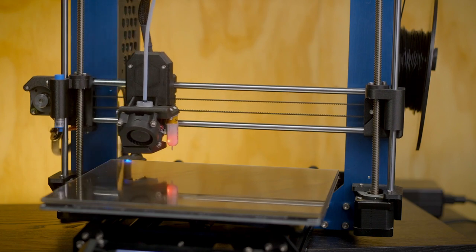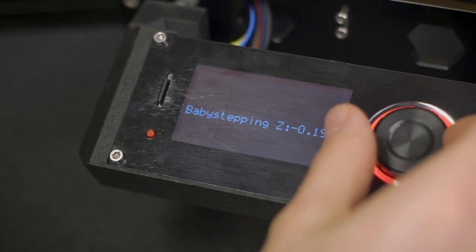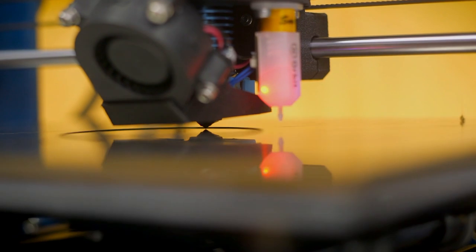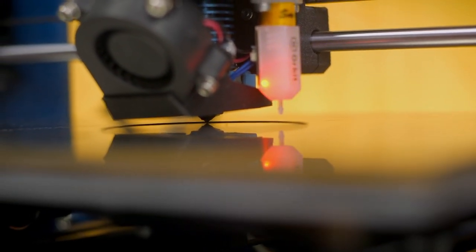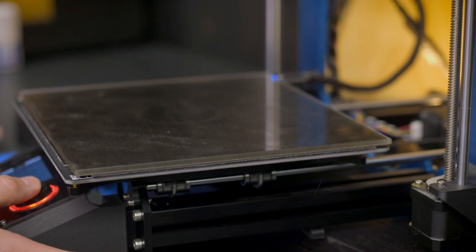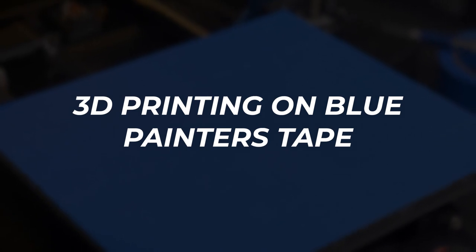The first layer is the most important part of your 3D print — it's the foundation upon which every other layer is built. You need the print surface to be level, and your Z offset set to the right height. Some bed surface materials will bond too well to flexible filaments, permanently attaching to them. Blue Painter's Tape or a heated glass bed with PVA glue stick or MatterHackers Stick Stick are ideal surfaces. Blue Tape is one of the cheapest and easiest ways to prepare a build surface for printing with flexible filaments.